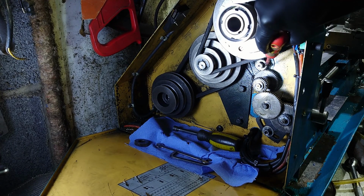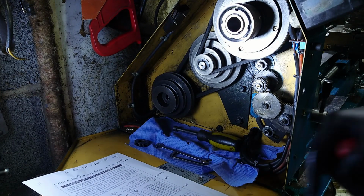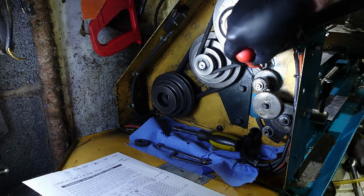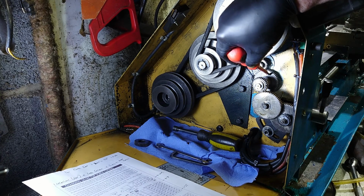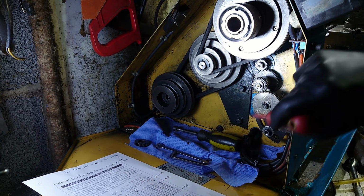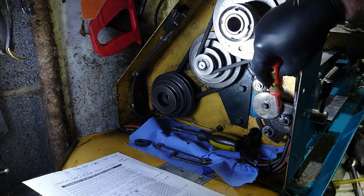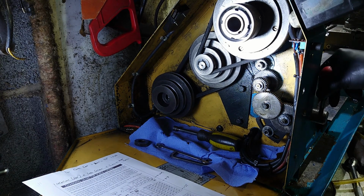It comes out on this pinion here, which is, let me get my sheet of paper. Okay, if I put a bit of paper down there, we'll be all right. So that pinion there is a 24 tooth, that one's a 50. So we've got a ratio there of 0.48. And then it's driving the gears as they are in the picture, A, B. C is behind B, and D. That drive there drives straight out through the dog clutch to the lead screw.